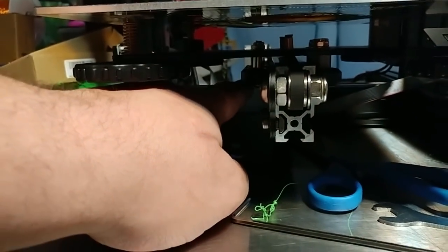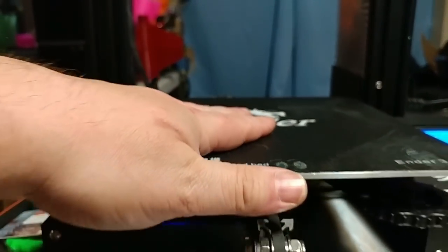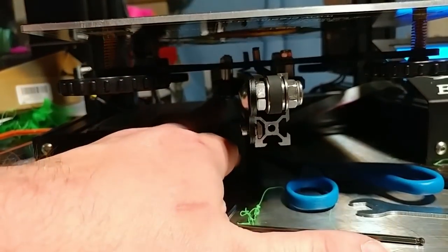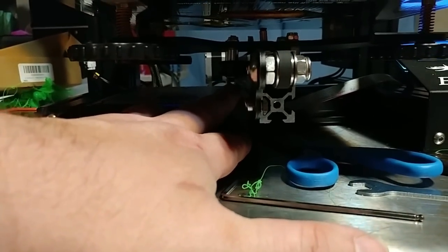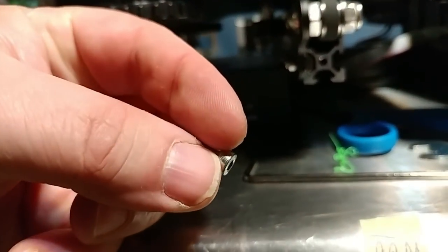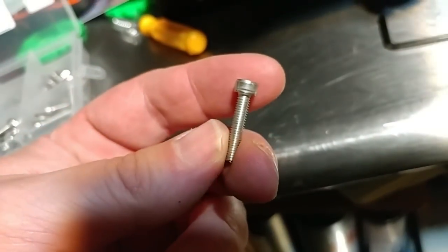Now that I've straightened out the one tilted post — I took it apart and reassembled it — the bed slides much more smoothly. I'm not sure how to prevent that in manufacturing, but maybe a thicker bolt through there, or better QC during assembly. I'd go with a cap screw bolt instead; there's plenty of clearance. I need to get some longer ones but that kind of hardened steel screw would hold up a lot better there.